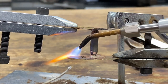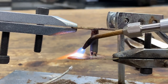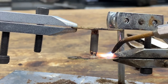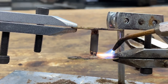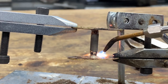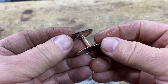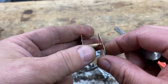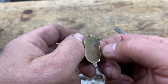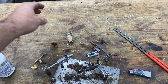Now let's go ahead and anneal this brace so we can bend it a little bit easier. We're going to bring this over. These torches are so precise. So here you've got your brace that you just made — throw it in the pickle so it gets rid of the heat varnish, buff it, sculpt it the way you want it, and you're good to go. Now you've made a solid brace.